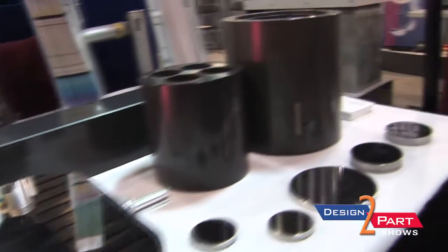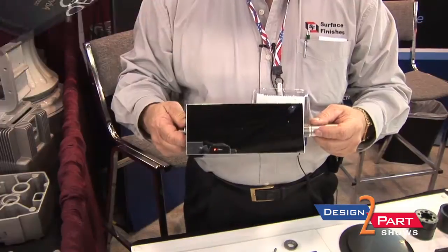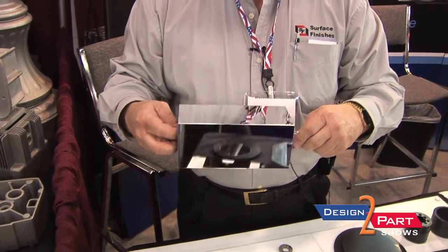Optical polishing is polishing any type of optical surface to a surface roughness that has no scratches in it, and surface roughness typically under 25 angstroms. Diamond machining uses a single point diamond tool in a fly cutting operation to create high precision and very, very specular mirrors.